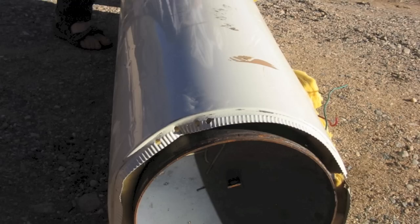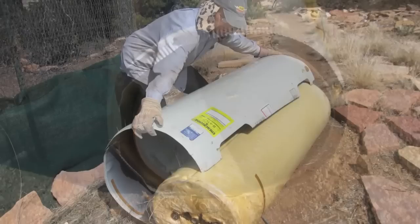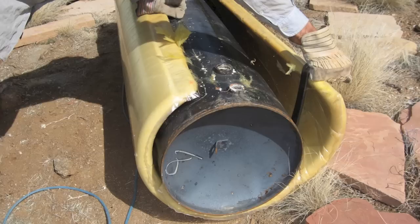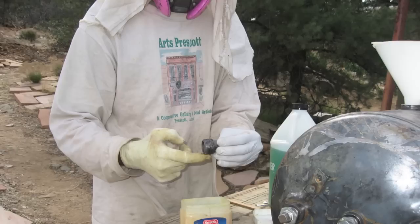When you've removed most of the easy things and you're down to the sheet metal, you'll need to get a saw with a metal cutting blade and run it along the length of the sheet metal covering so that you can slip it off. Once you pull the sheet metal off, you'll be looking at the foam covering of the tank. Some come off easy, some come off hard — this one came off relatively easy by just using a flat bar to pop it off.